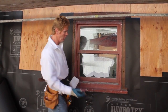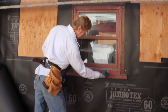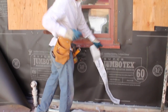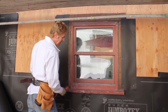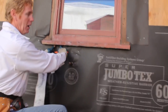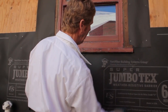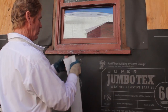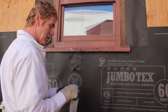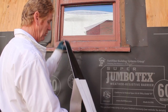I've shown folks this before on sills that are a hundred years old. What I did is I brought my paper up here, went past the sill, cut it here, and then what you see is underneath here. You can put a bead of silicone — or not silicone, polyurethane — caulking up here. There's another way to do it, and because this house is so beat up, this is the way I said I would do it.